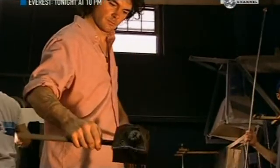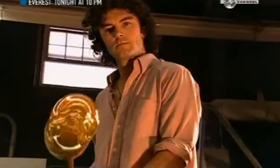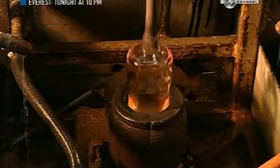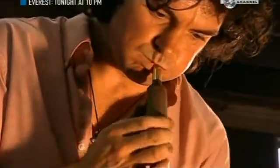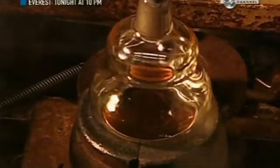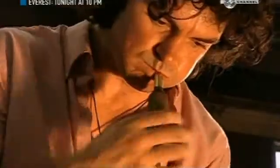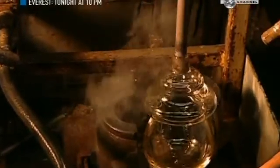Now he begins shaping the ball, using various wooden tools. This one's called a block. He uses another tool called a divider to create grooves so the ball will fit into a mould. He now inserts the ball into a steel mould, one of 150 this company uses for its collection. The craftsmen coat the inside of the mould beforehand with a paste of cork dust, linseed oil and charcoal dust. This prevents the ball from sticking, which would cause flaws in the crystal.